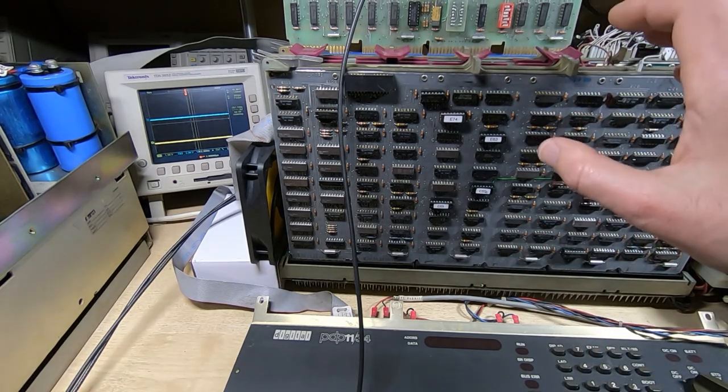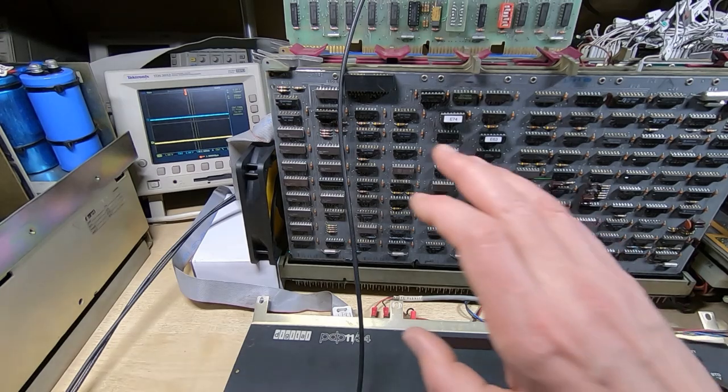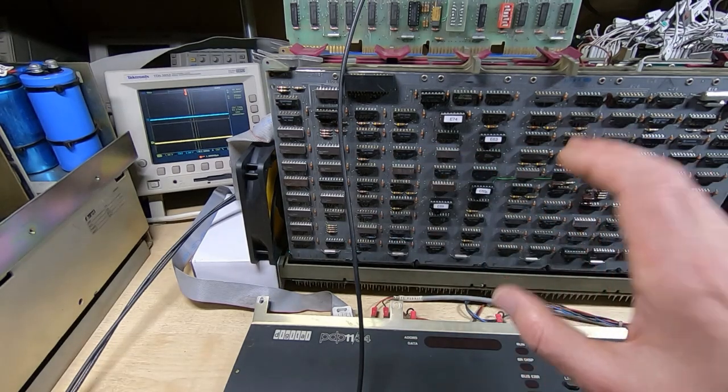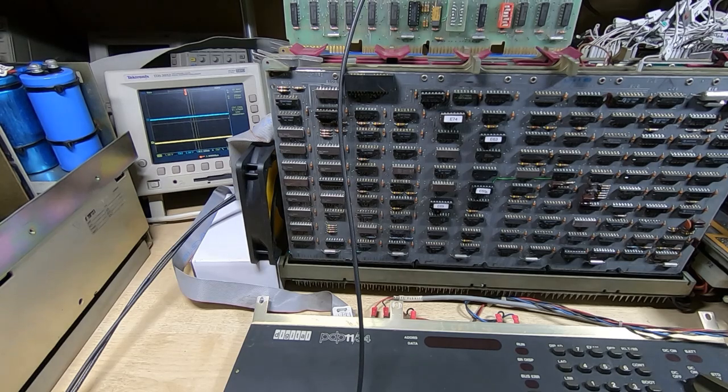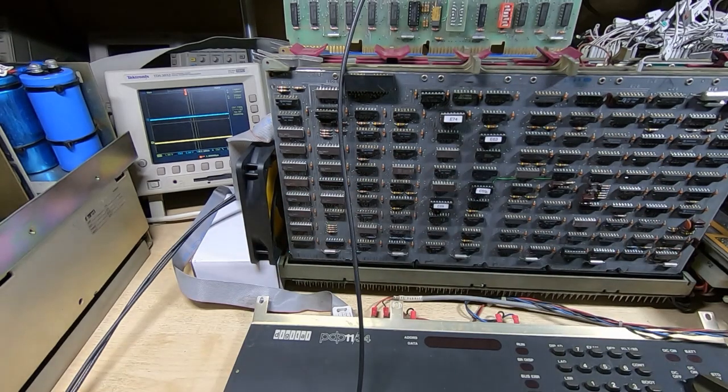I've got the RX211 on some risers. That's currently what I'm working on. I'm trying to get the floppy drive system to work. It did initially read the floppy disks. It wouldn't boot because I think the floppy disk I had at the time was corrupt, but then it developed yet another fault. I've had a lot of faults with this machine, and currently it will not properly read the floppy disks. So what I've got here is an RX211 controller coupled to the RX02 dual floppy drive.